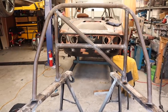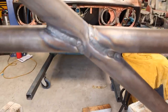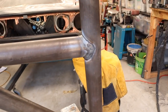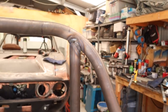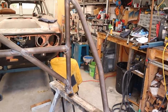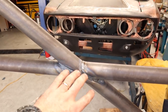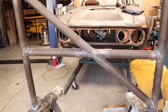We have the cage and it's all welded up and I am absolutely in love with the TIG — it just welds so nicely. The welds really flow. It's quite simple to do a nice even weld without adding too much material, which is what I find with the MIG. Every time I use the MIG on big stuff like this it tends to add just too much material — even turning the wire speed right down the welds come out too big. With TIG you just add as you need and it flows so nicely.